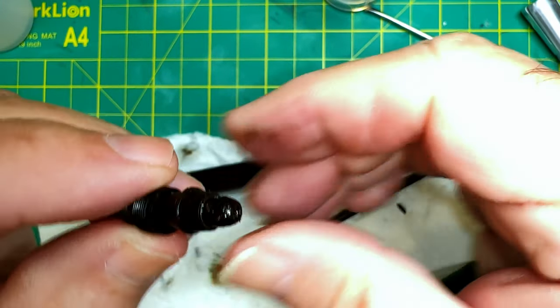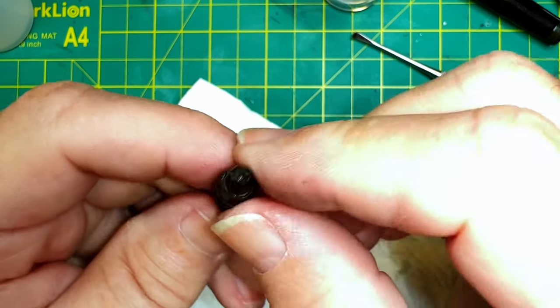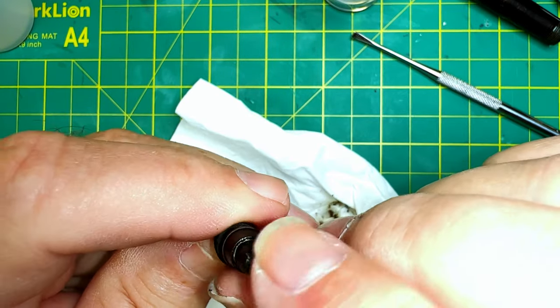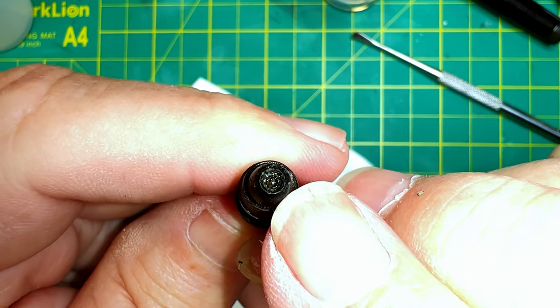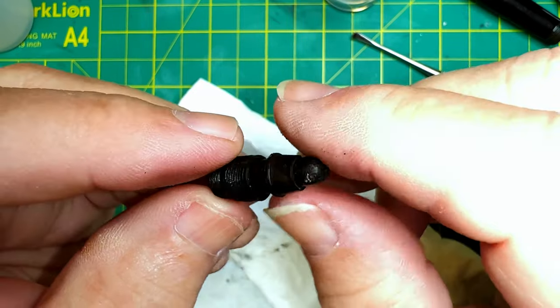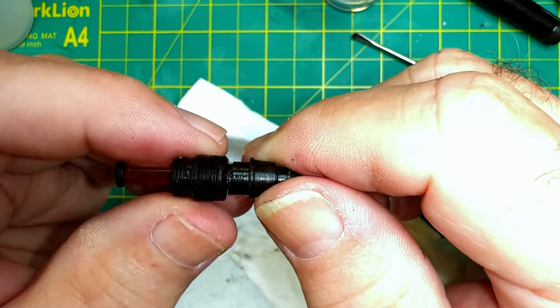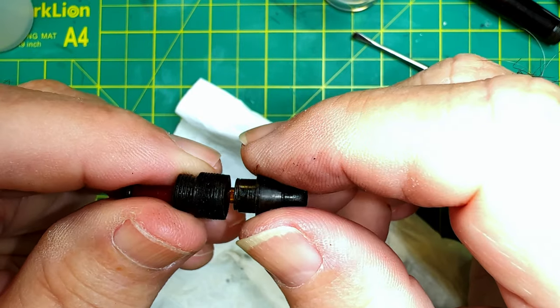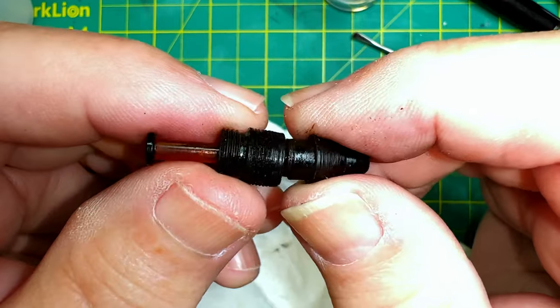Spring works well, and the cup seems to be in good shape. So now I'm going to use my Dremel tool to drill out that little pellet right there and get it ready for resacking. But it needs a lot of cleaning up. Those threads are just jam-packed with, I don't know whether it was glued in there or what, but it was the toughest one I've ever had.